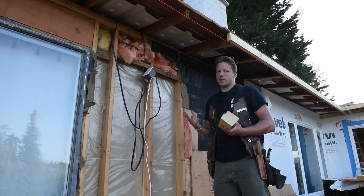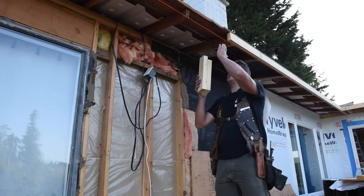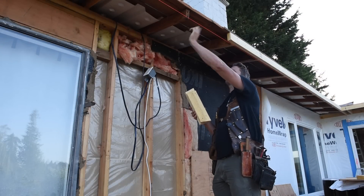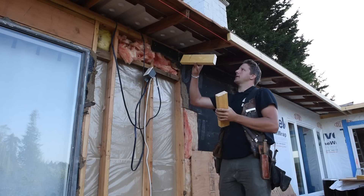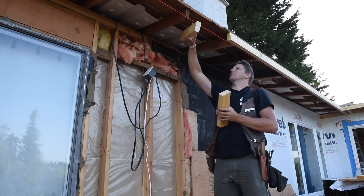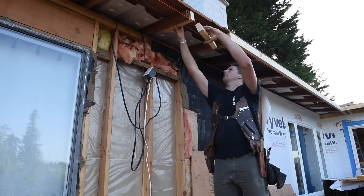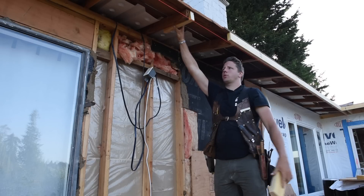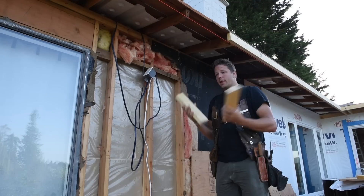The last thing I've got to do before I can put this roof on is finish framing out for these soffits — or at least the fascia — so I can get my fascia board on and then build up my cant strip to do the gutter. The old fascia was 90 degrees to the roof pitch, but I'm going to plumb it vertically. I'm just adding little blocks to all the rafter ends with a string line set up, then screwing those in and framing the soffit in after. This allows me to set my board along here and have a nice straight fascia board, then attach my 2x12 primed fascias and get going on the roof.